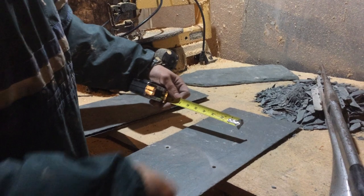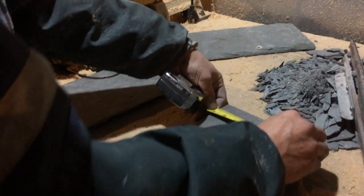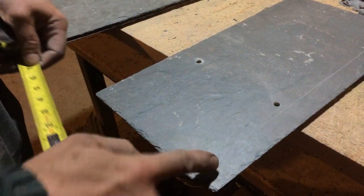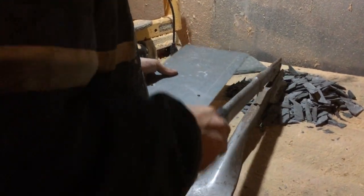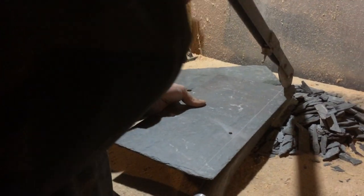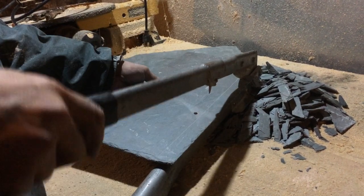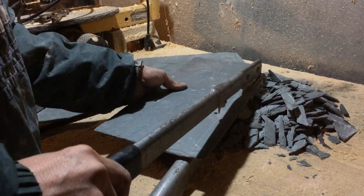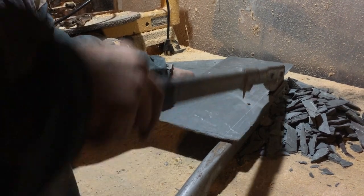I need a seven inch wide piece for the edge, so I usually just hold my hand here as a guide on seven inches, watching the edge where my hand is guiding, then mark it to get a nice straight line. I marked the backside so that when it breaks out we get this natural look. I'm going to gently but firmly go down through and out. It's better to go on that side of the line, then come over and mark it to get it closer, because sometimes if you try to get it all in one shot it breaks away too much and you get waste.